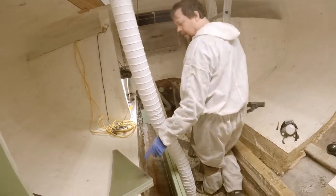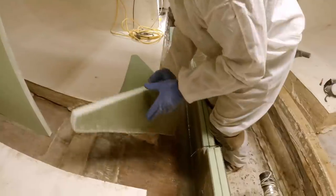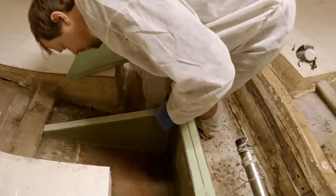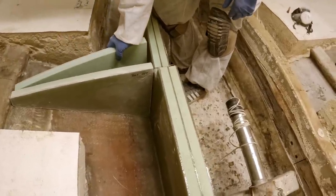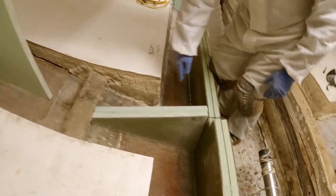These are the beginning of the bulkhead support. We got these cut and fit. Oh, now they don't fit because there's tabbing there. I'll have to knock a little bit of tabbing off of that. Those will go in there like so, and tie into the bulkhead right here.